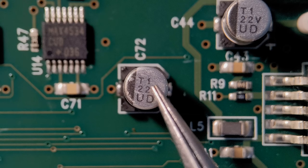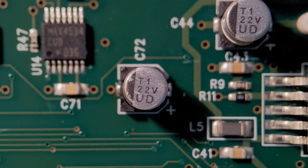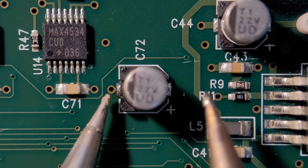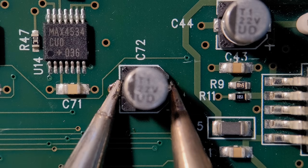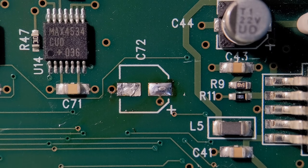Another great use for two soldering irons is removing small to medium electrolytic capacitors. You can do these with hot air, but I don't like really using hot air on this type of device, especially the large ones — I've seen them go pop. I've added a small amount of fresh solder to the joints just to aid the removal. Just get two soldering irons laid on, just be patient. Just like that — remove, twist, start twisting, just get that slid off. Nice result there. All we've got to do is clean the pads up and that's going to be ready for a new device.